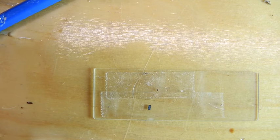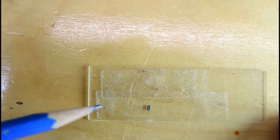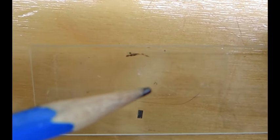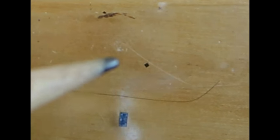I have my answer as to why one costs more than the other. There are two silicon dies on the slide and it's very hard to see one of them. The Maxim part looks relatively small, but right up here in this little dot — which is virtually impossible to see — is another beast of silicon, and that's the LM321, the regular op-amp.